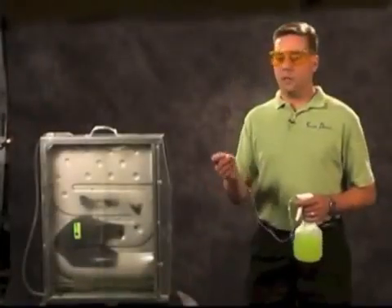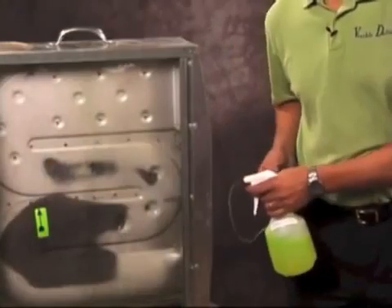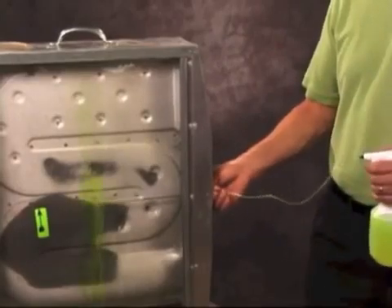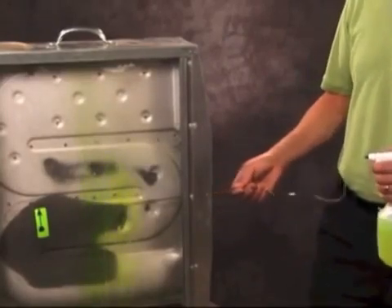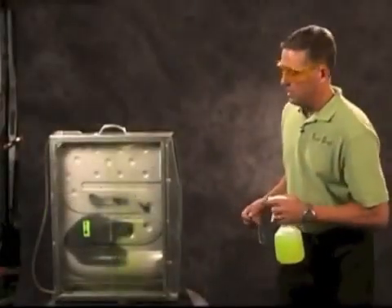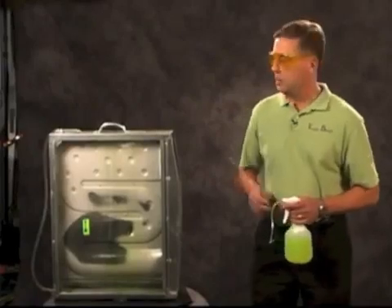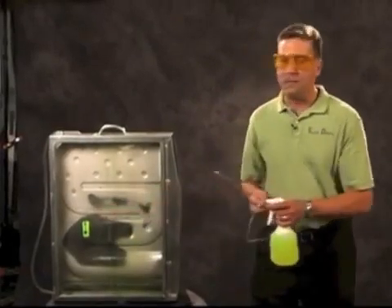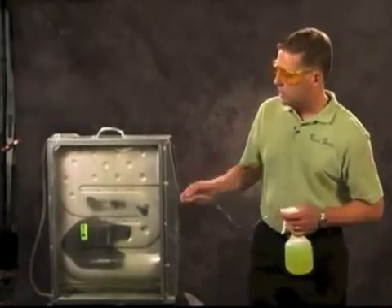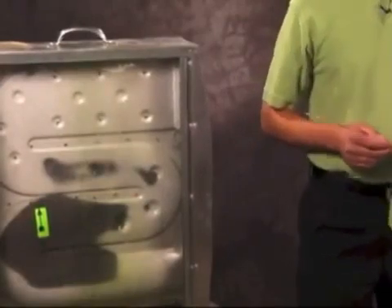To use the system, take the 11-inch spray bar and insert it in any screw hole or through the insertion limit. You'll notice it'll get about halfway through the heat exchanger. As you spray, it sprays the full heat exchanger top to bottom. If you're in a closet and don't have access to the back of the heat exchanger, there's a spray nozzle you put on the hose so you can soak the back of the heat exchanger without getting access to the back of the furnace.